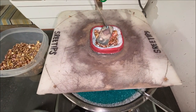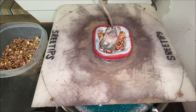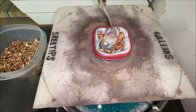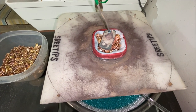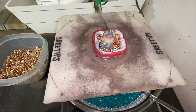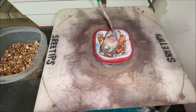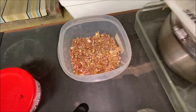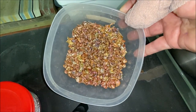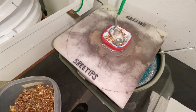Another question I was getting in the comment section is: why don't I just put the cement silver directly into the anode filter basket? The answer is I've tried it a couple times in the past, but the cement silver clogs the filter up, the electrical current drops off, and it just does not work well. The silver granules are the best way to go as feedstock for the silver cell.